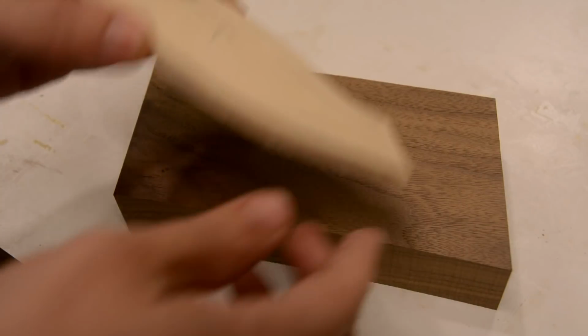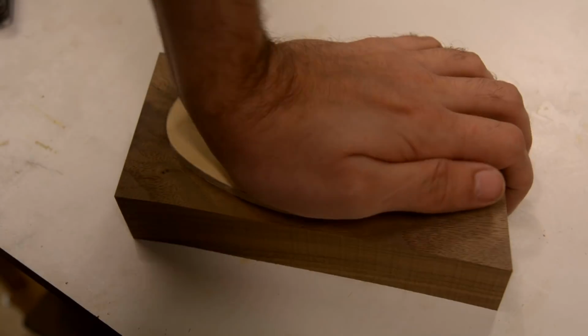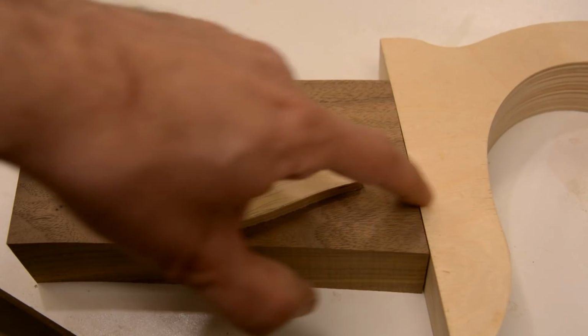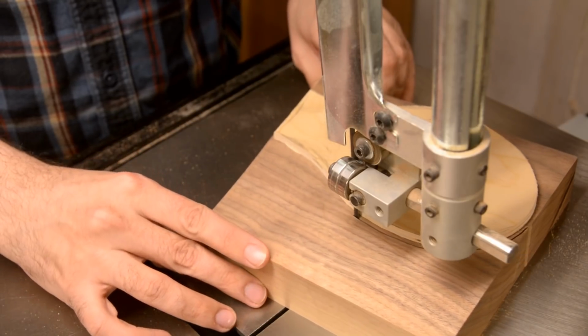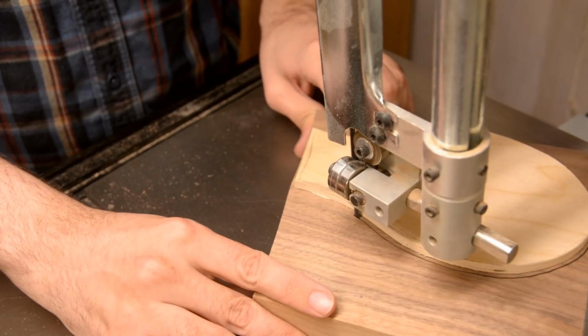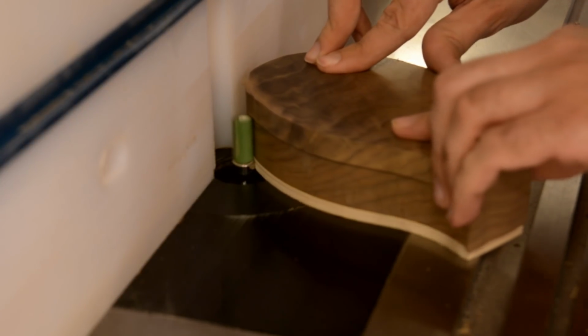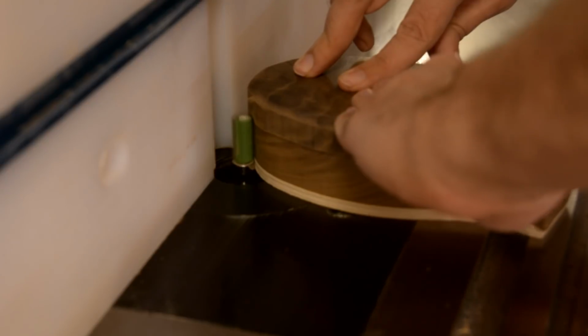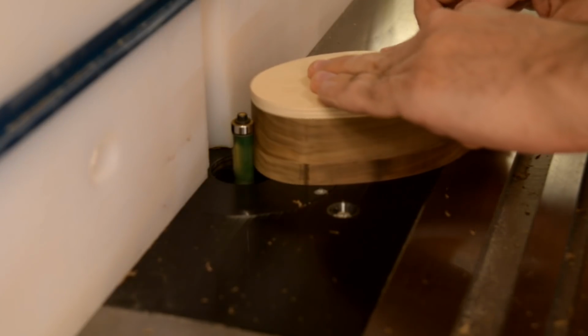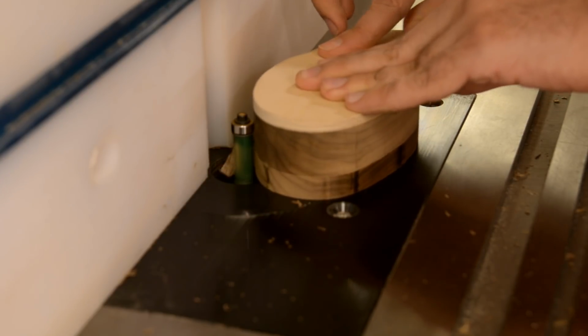The bandsaw boxes are made up of 3 layers of the 8/4 walnut, and the middle layer has been planed down to the same thickness as the frame, and that gets cut to be the exact size of the template. I didn't have a flush trim bit that was long enough to do the whole thing in one pass, so I started with a top bearing flush trim, and then switched to a bottom bearing and flipped it over. That bottom bearing bit was really dull.